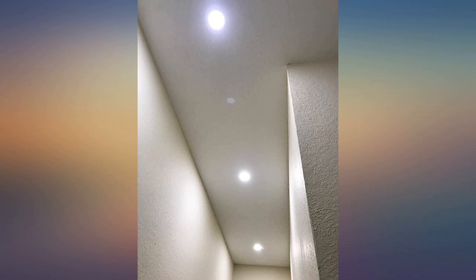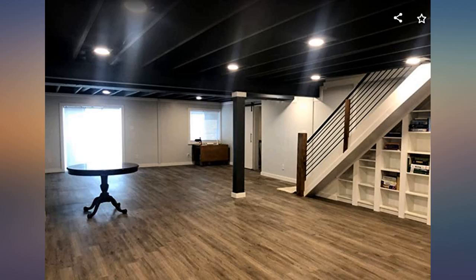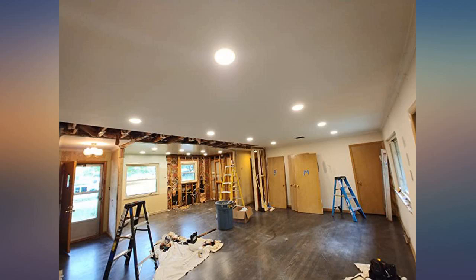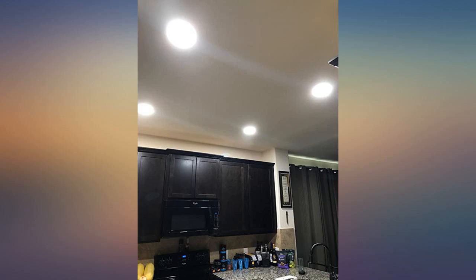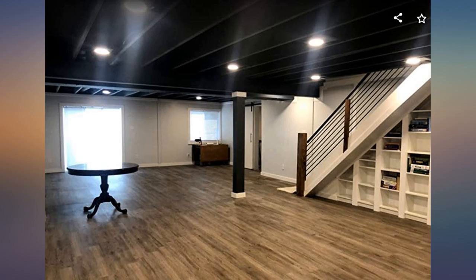Bought the 6, 4, and 3 inch versions throughout my home. Love these lights. I use them professionally as a residential electrician. They are cheaper than anywhere else you can buy low profile can lights. They may not be the brightest at 850 lumens — a 60 watt bulb is 600 to 750 lumens — but being so close to the ceiling it looks bright. The fact you can install them on a stud is amazing. I've never had one defective one or one go bad, and I've used over 30 of these so far.